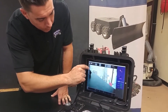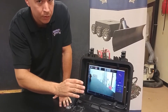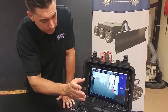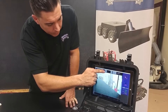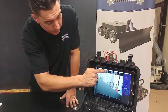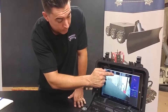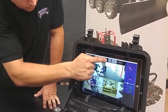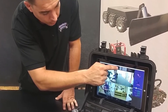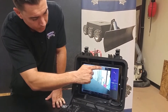The robot speed — high and low — is shown in gray. You can home the pan-tilt-zoom camera if at any point you get lost; simply press the home button and it will zoom back to the front and forward position. You can park or stabilize the flipper arms: pressing park puts it in the closed position so you can drive around uninterfered, while stabilize is used for tackling steep inclines. Quad mode displays all four cameras — the nose camera, the arm camera, the drive camera, and the rear camera. You can also select a specific camera with one of the top four buttons on the right.